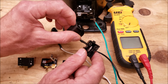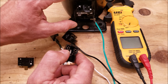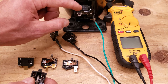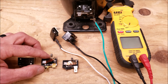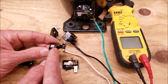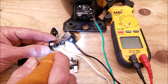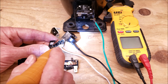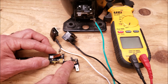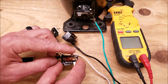On this one I've removed the disc inside and what's going to happen is it's not going to be able to start up because it's not going to get any power to the start winding. If you have a high amperage situation, there is a little electric resistance coil on the inside. Power goes through that coil and then across this little brass piece to get to the other side in order to reach the common terminal for the compressor.